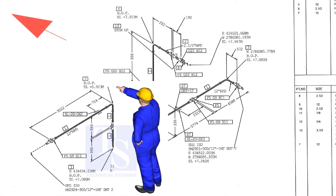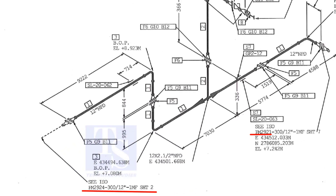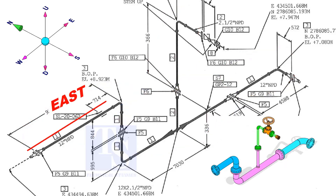As per the drawing, we are facing north. This drawing is between sheet number 2 and sheet number 7. If you see a drawing of several spools, you can imagine the pipe is internally coated or lined, or the pipe is galvanized. The header part goes to the east, down, east, and to the south.